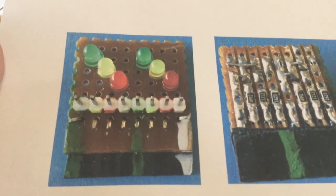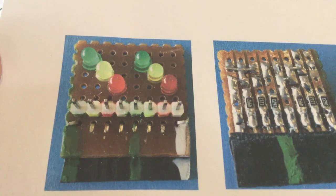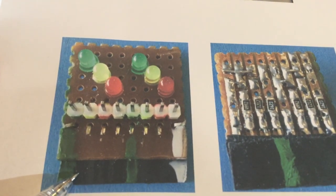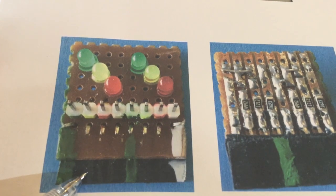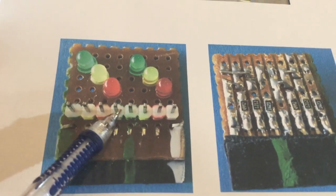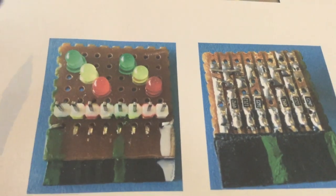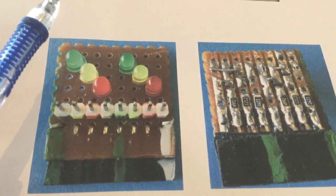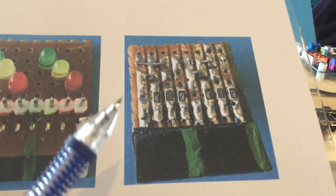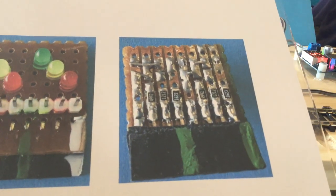The test light board that sits on top is really crude but really simple. It has a female header that pushes onto the pins on the board and a male header so I can bring them out again and connect other light boards. It has the lights for bank 2 and the lights for bank 1. Each light board has its own resistors on it for the LEDs.